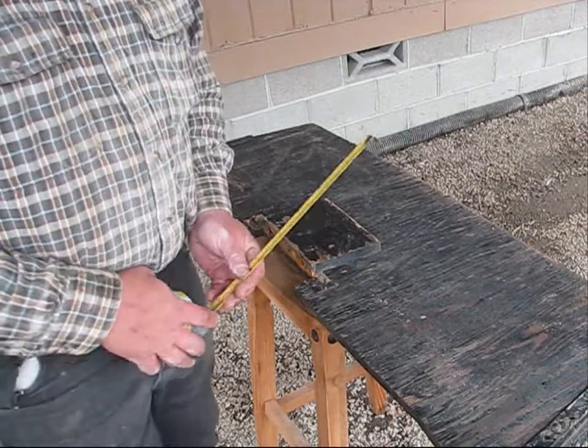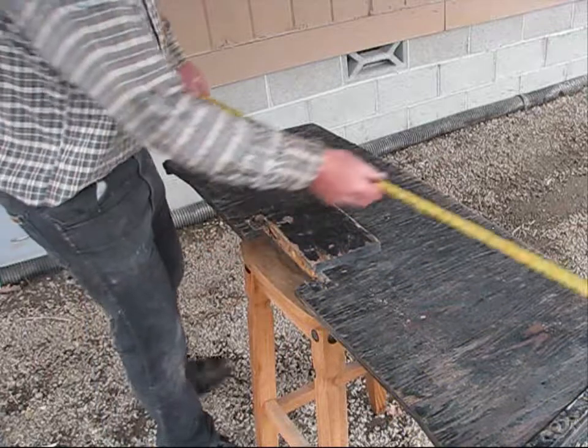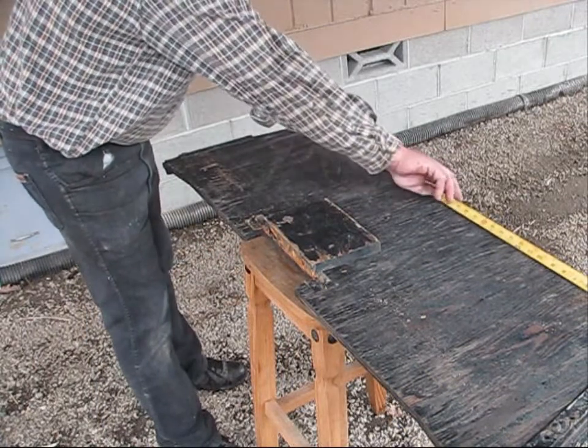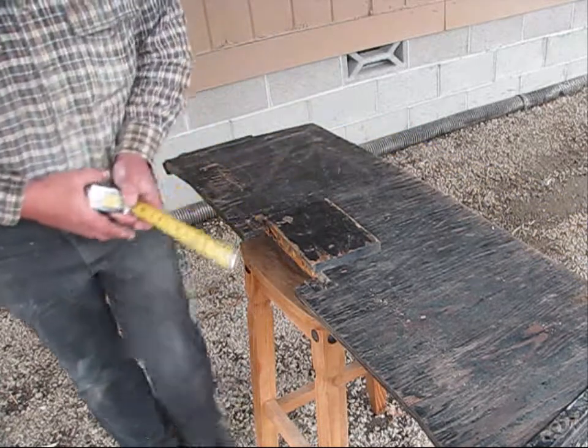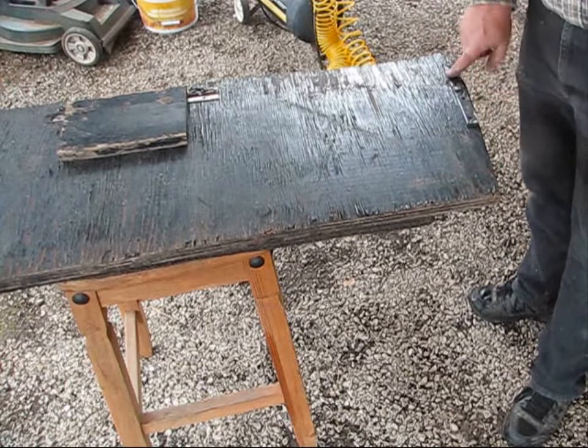So it'll be 4 feet at the top for the transom, and the bottom where it tailors down, it's gonna go down to 43.5 inches and then angle down. So don't forget to put in the supports here.